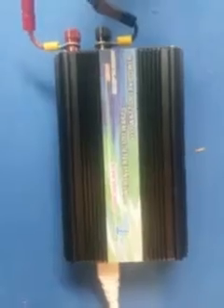This is just an example showing a very small inverter. I have a 3,000 watt, but this is a cheapo 300 watt pure sine wave inverter — it actually works pretty good. I think I paid $35 for it on eBay. I've got a 300 watt lamp running over there, and here you can see I'm pulling about 28 amps, with about 12.5 volts and about 330 watts. It's a 300 watt halogen bulb, so that comes out about right.